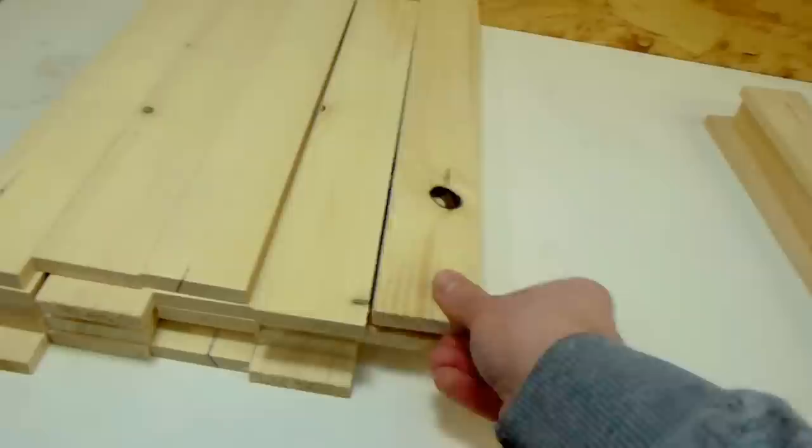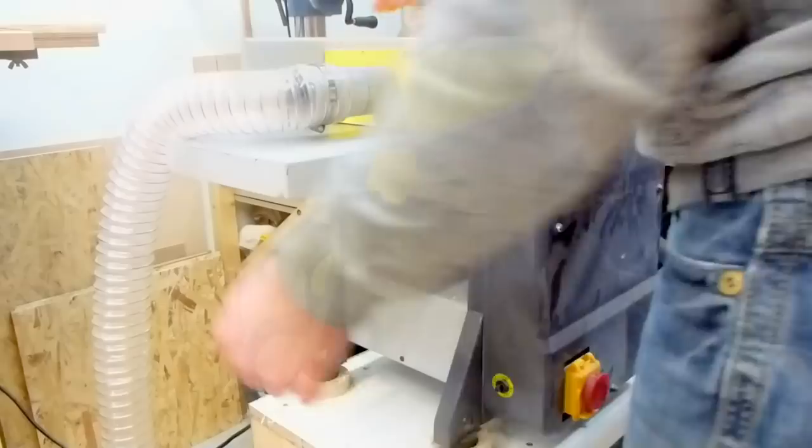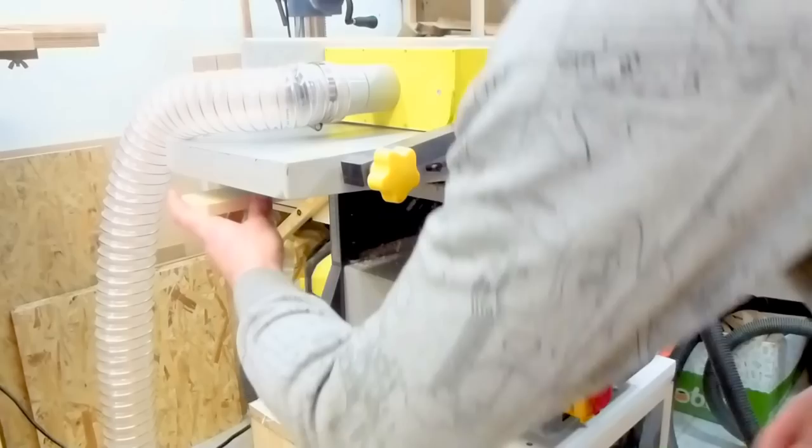I got all the pieces cut. The leftover ones that are too thin — and one of them lost a knot — meant I still have 24 pieces, enough for the bucket. Now I'm going to plane them all to a consistent thickness. Thanks to jointing in between resawing, I now only have to plane once.